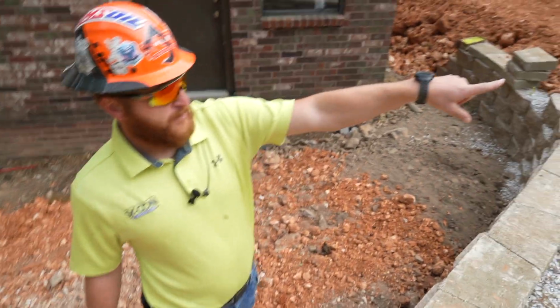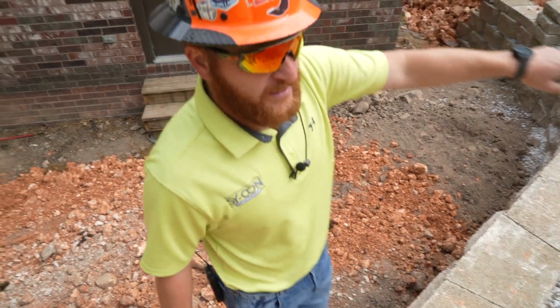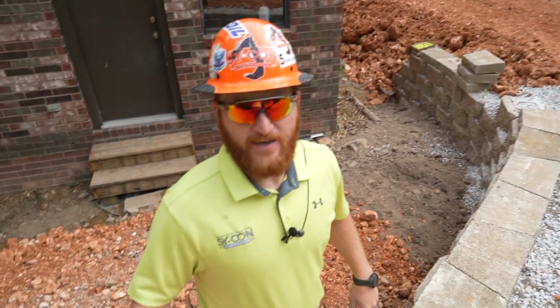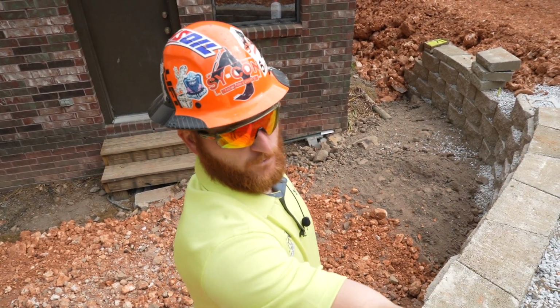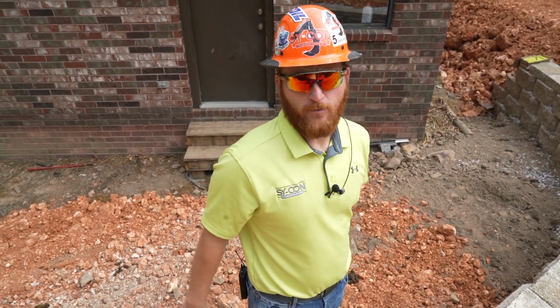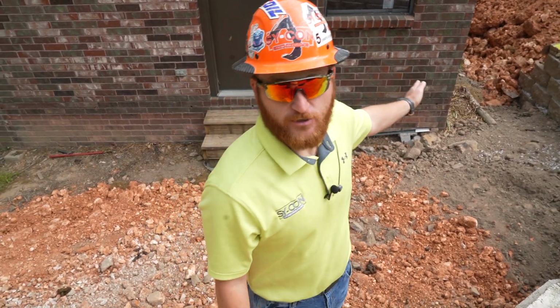That 42-inch pipe that Bill's moving right now, he's gonna be bringing in. We're gonna be laying that right in the middle of their brand new constructed road. And that's gonna move all this water that I keep talking about. It's gonna drain to a point and move out that 42-inch. We had to establish grade first before we could just start putting stuff in the ground. This wall was part of it. Need that gas service moved.